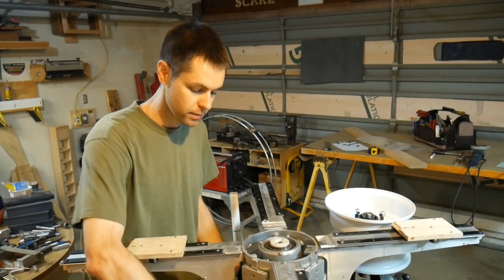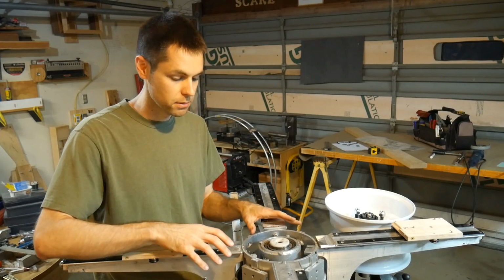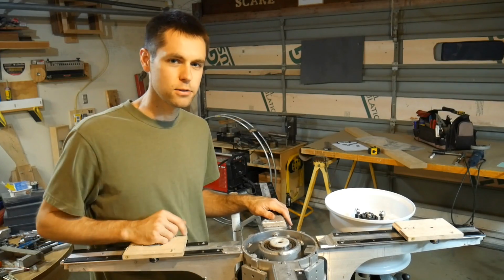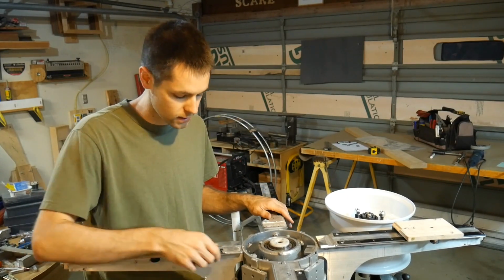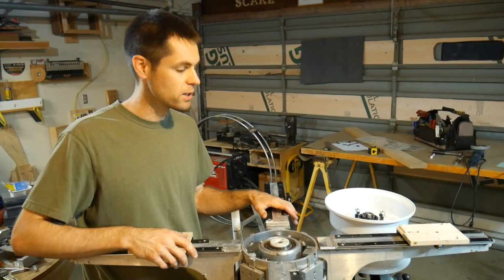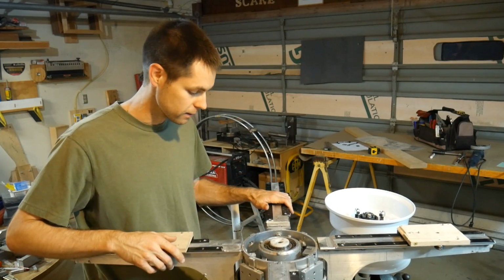We'll figure out a way to make it happen. If I could shift some of that mechanism down, it would really open up our possibilities here. And even if we kept things very similar, it would just reduce the space constraint, so that when people build it, it won't matter so much if their screw's a hair too long or whatever. You won't have to take it apart and grind it off in order to get this clearance. It makes it easier. That's something that we need when we go from design to production, is to allow wiggle room for reality to show up and intrude and make things go wrong.